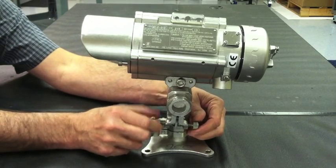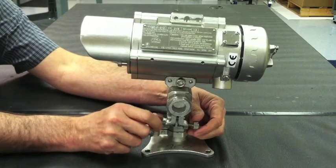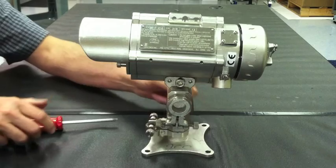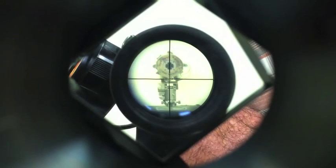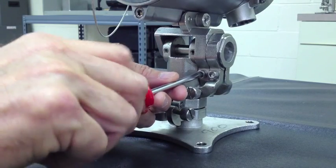Notice the two adjustment knobs attached towards the mounting plate. Begin to turn the two knobs simultaneously in opposite directions to meet your final adjustment position along the vertical axis. This is what you should see through the telescope when making your final vertical adjustments. Once you have reached your final position, it is time to tighten the last adjustment bolt.